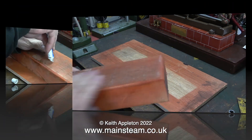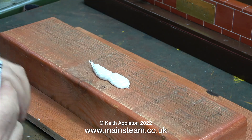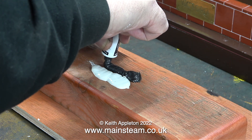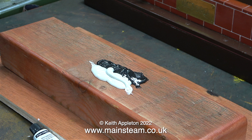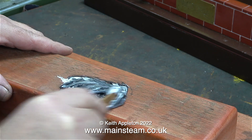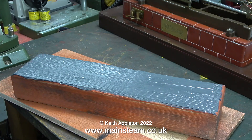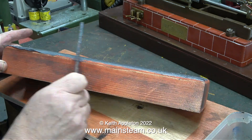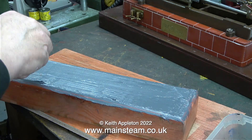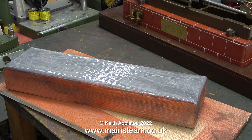In this clip I'm rubbing it down with some emery cloth. And now I'm going to coat the entire top of this piece of wood using JB Weld — this is really good stuff to use. It's a two-part epoxy resin mix, and this one is the marine version. I'm going to mix it on the wood itself — provided I mix it thoroughly, I shouldn't have a problem. This next clip shows me mixing the resin at an incredibly high speed; the video is running at 800%. I continued the mixing process until the epoxy resin was an even colour throughout, then I spread it on top of the piece of wood. This JB Weld is the 24-hour version, and when it sets it should level up a bit more. I'm using a small amount of water on my spreading stick to get a nice smooth finish. Once this JB Weld has set, I'm going to thoroughly flatten it off using my belt sander, but as you can see, it's already quite flat and smooth.